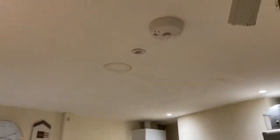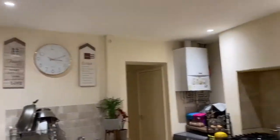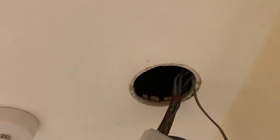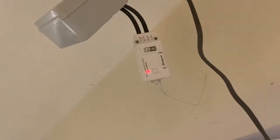The centre light is just on a dimmer. I also fitted these two disc lights, which work on a PIR — so when we come down in the night time or morning, we've got lights that turn on automatically. They're on a dimmer too, so they're dimmable. Because we've got these nice big holes, all the wiring for the down lights is brought back to one place, giving us a neat little junction box and the Quinetic receiver.